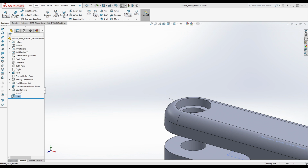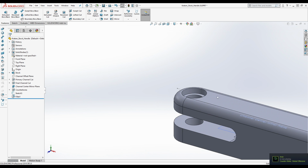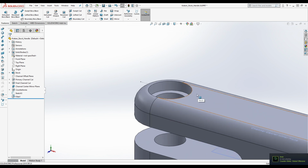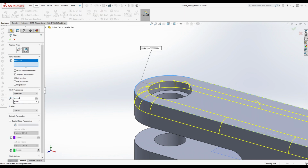2 millimeters is, I believe, 79 thousandths, is 78.7 thousandths. And so instead of buying a 0.08 roundover bit, even though everything else here has been inch, he probably is using a 2 millimeter radius or corner radius mill. So instead of that, we're going to change this to 0.0787.